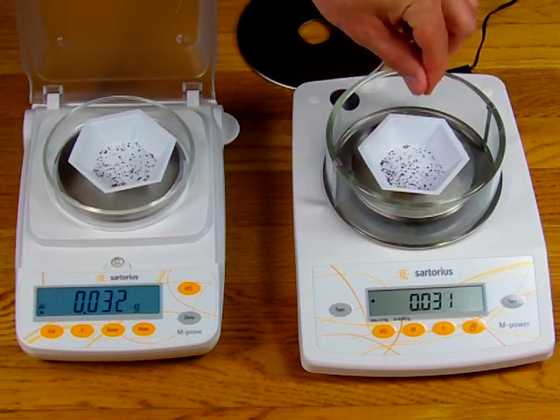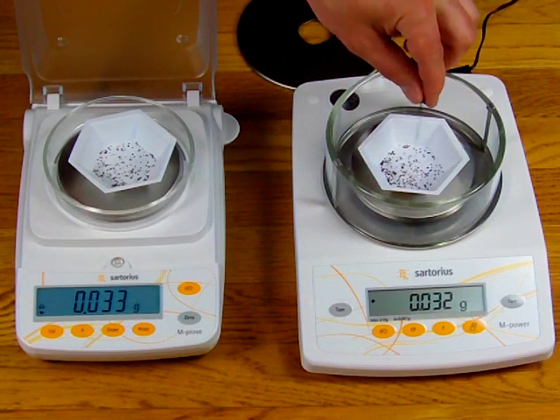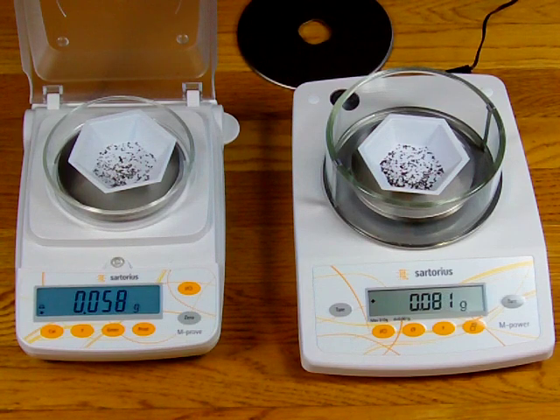I'll just drop a lot of tea on and you'll see — boom, it's done immediately. Now I'll use larger quantities. I'm going to drop a pile and look at the response time and how stable it is. I'll do the same thing with the strain gauge based scale — drop a pile of tea on — and look, the balance is running, running, running, and I'm away from it. On the force restoration balance I drop a lot of tea: it stops right away at 81 milligrams. I come over to the strain gauge based scale, drop a pile of tea, and the number just keeps going and going.